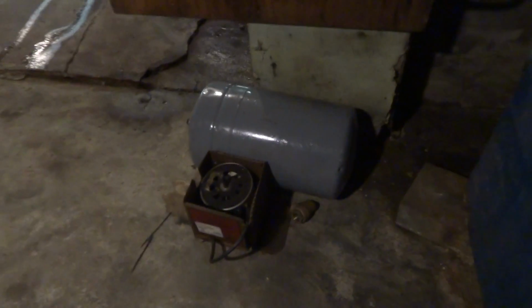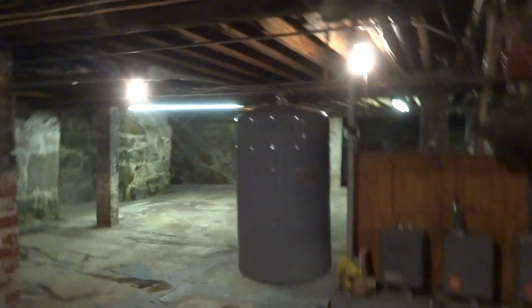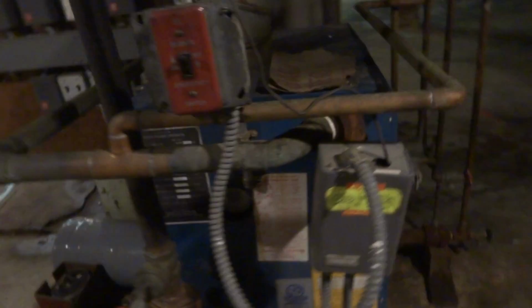That's it. Alright, I just make sure the boiler's back on, which it is. I just left in this pile of stuff there that's been used. New expansion tank. That's why the relief valve was blowing the other day, building up pressure to 30 pounds and blowing. That's it. Ran the thermostat upstairs. Should be good.